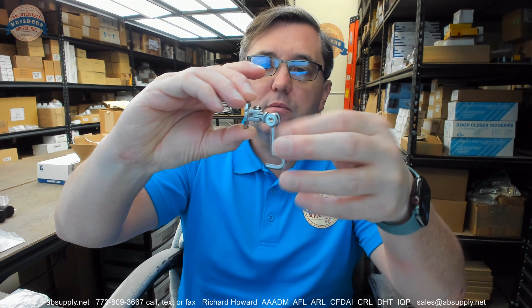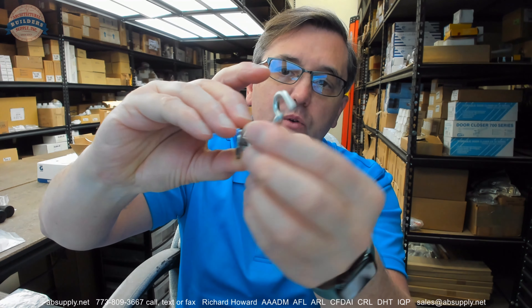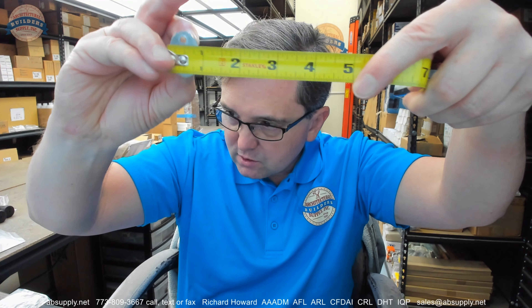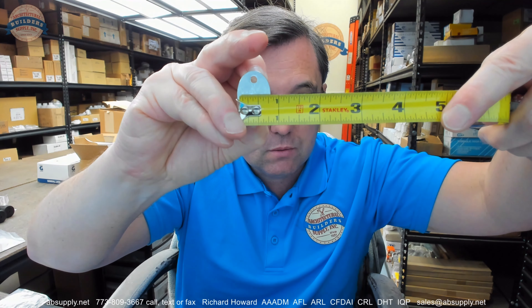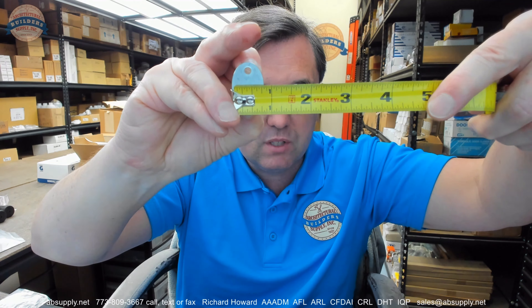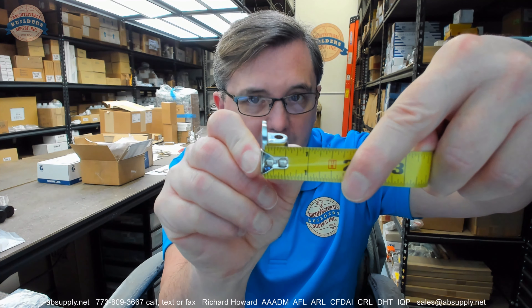We confirmed our A dimension was two and a half inch, and we showed the other sizes available. It's a unique hook — there's no doubt. It's definitely a cabin hook. The hook plate is an inch and an eighth tall, which indeed it is, and it is 27/32nds wide — 0.84 inch, basically 13 sixteenths. The projection of the unit — of the staple, so to speak — is about 9 sixteenths.